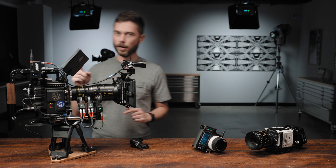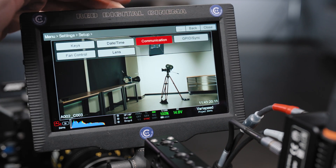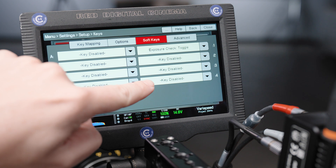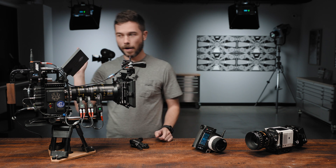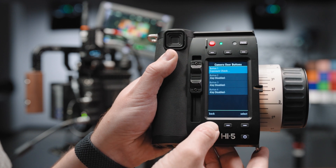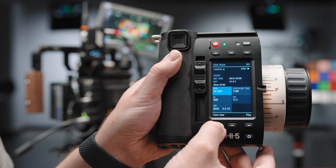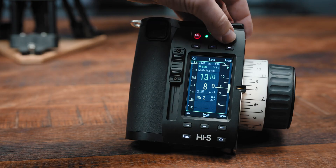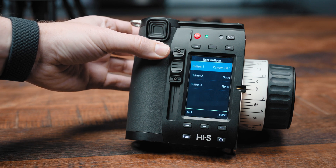On the camera, go to Menu, then Settings, then Setup, then Keys, then Soft Keys. You'll see buttons 1, 2, 3, and 4 on the right-hand side, and they correspond to the user buttons 1 to 4 on the Hi5. I've set user button 1 to be Exposure Check Toggle On or Off. If I go into Cam User and hit Select on button 1, the Exposure Tool comes on the RED. You can also assign one of the Hi5's physical user buttons to control one of the camera user buttons — I've got button 1 triggering false color on the RED too.